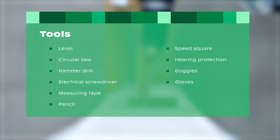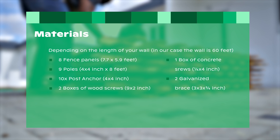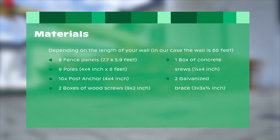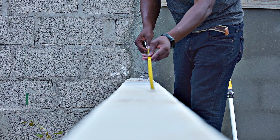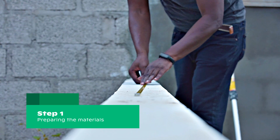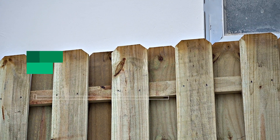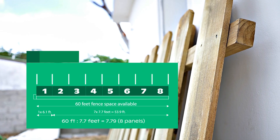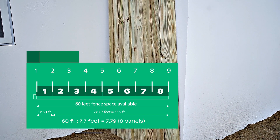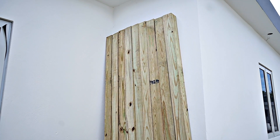Make sure you have the following tools and materials. Building a fence is not very difficult; however, it is a two-man job. First of all, it's important to know the amount of fence panels and poles you need. The fence panels we have chosen are 7.7 feet in width. We divide the total length by that and round upwards. We have 60 feet, so we need 8 panels in total. The total amount of poles needed is one more than the total amount of panels used — in our case, that is 9 poles.